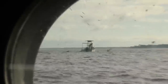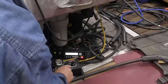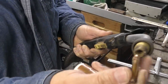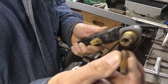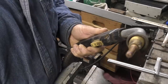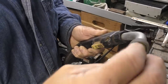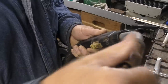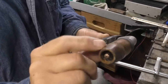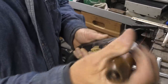It's crab pot collection day — look at them line up. This is a Bernard centerfire gun. It's a little more expensive but worth it. It's got a tip that's not threaded, it just presses in, and the nozzle is insulated. The nozzle keeps the power on the tip but not on the outside of the nozzle. When it starts arcing off the side of the nozzle, you know you've got too much spatter built up and you're electrically connecting the two.